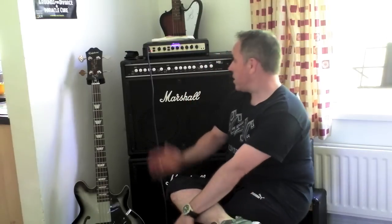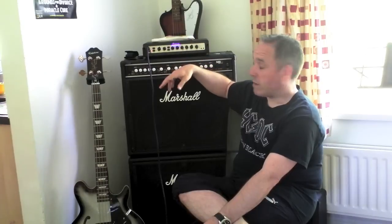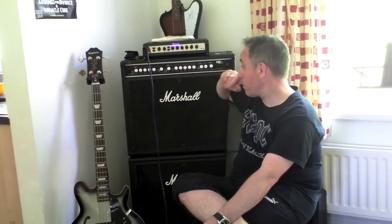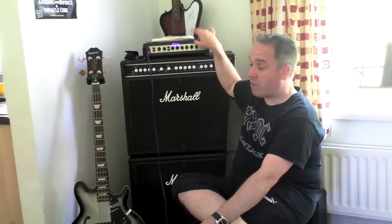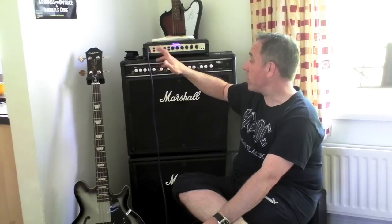Now, you need to follow this procedure when you're first setting up your bass with the amp. Plug it in and connect it all up. Make sure the compressor is set to 0. So you're setting this with no compression, just the pure signal coming in uncompressed, straight from the bass. You can have the volume at whatever you like, but I'd have it fairly low during this setup procedure. In fact, you can have it off altogether if you wish, because it doesn't really matter.